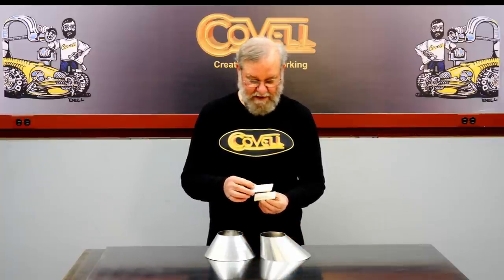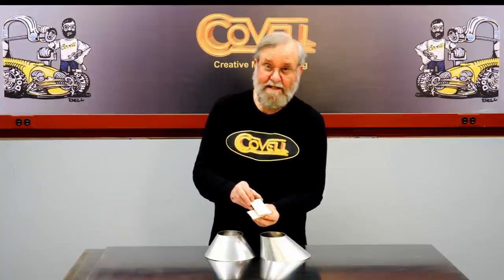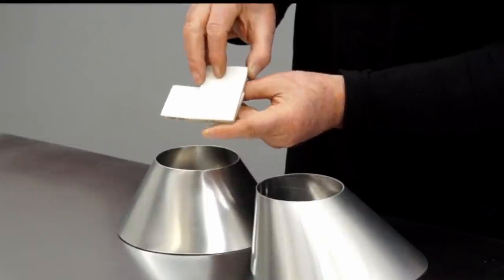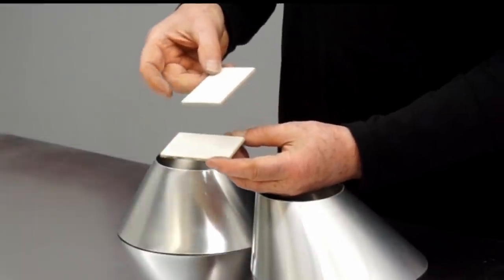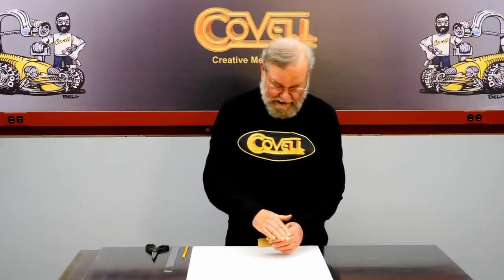I'm going to make a transition between two rectangles, rotate one 90 degrees, space them a certain distance apart, and rather than have them centered, I'm going to offset it so that one corner on both rectangles lines up. I'll get a block of wood to space these the right distance apart. I've assembled all the pieces for the form, and I've used two screws on each side to make sure these rectangles can't move.